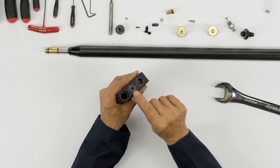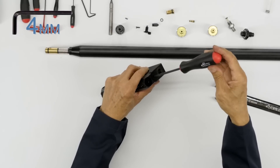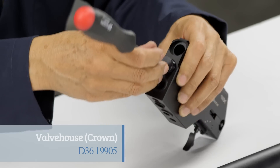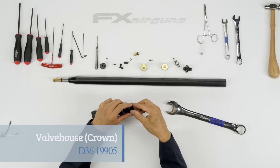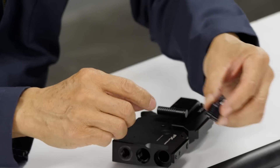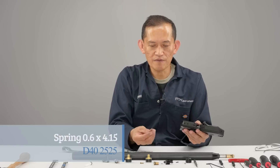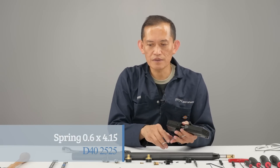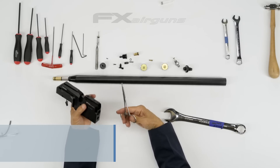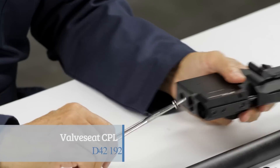Here is the valve assembly — we're going to remove that. It's the valve assembly retainer and it requires a four mil. Here's the valve. Here's the valve retainer with the o-ring. It has the spring retainer right there. Grab a tweezer — sometimes the spring falls out, but usually the valve stays in place. The valve seat is in there, and you use a little tweezer. There's a little notch on it — usually it catches on the notch and lifts the valve seat out.